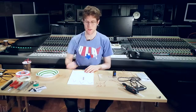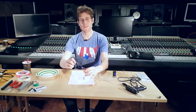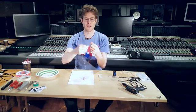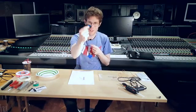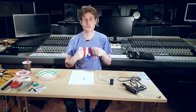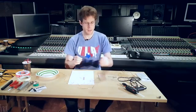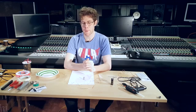What we need to do is take a regular magnet. Here we have a stack of neodymium magnets, and we need to make what is called a voice coil. A voice coil is really simple. It's a copper wire wound into a coil. A property of a coil is that when you attach electricity to it, it becomes magnetic. It creates a magnetic field. When you take the electricity away, it's no longer magnetic.